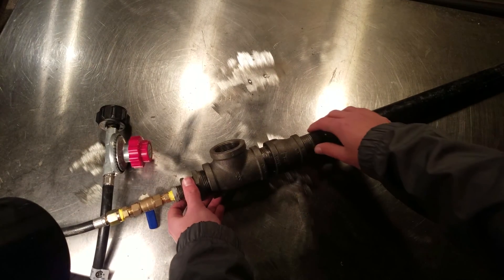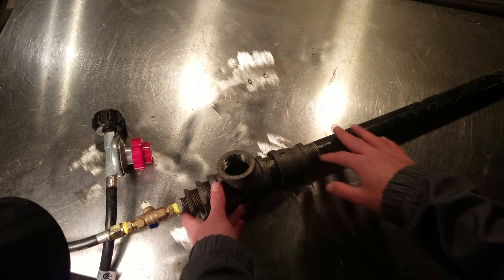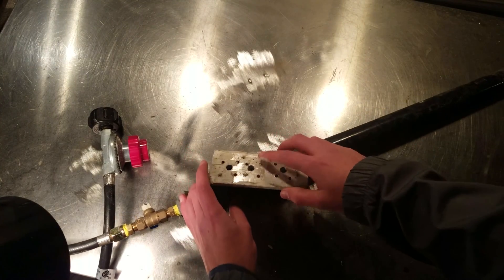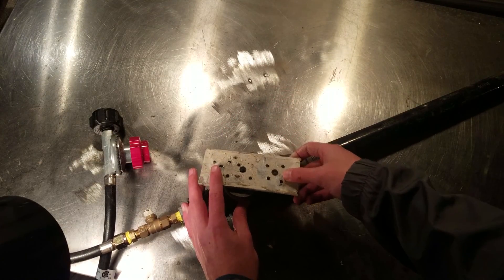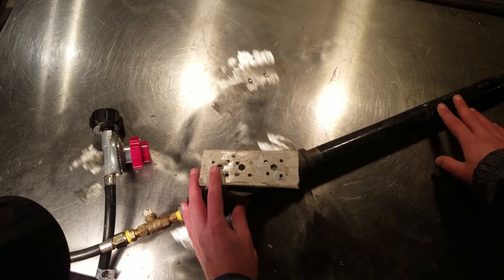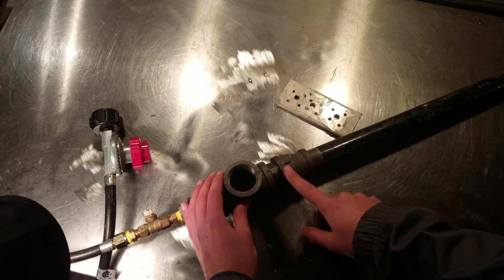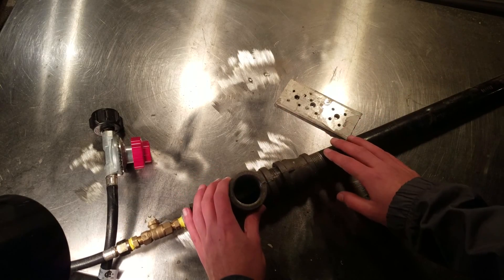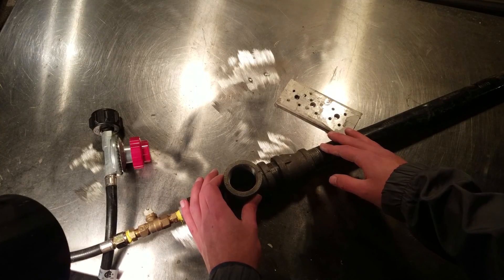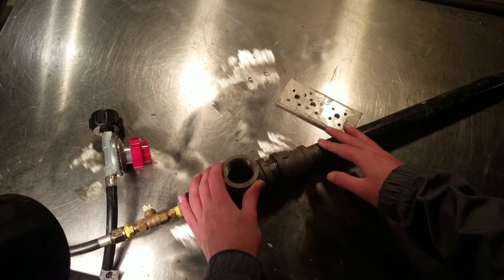Basically, how I regulate airflow is nothing too advanced — I honestly just use something to cover up the hole, and I slide it on and off to adjust how much air inflow is getting in. At the moment it's not forced air. I have plans to make this a forced-air propane burner — some sort of system to pump air in — because right now I can barely run this at 10 PSI without putting too much fuel into the flame and the propane not burning correctly.